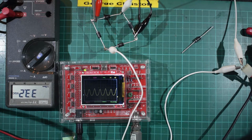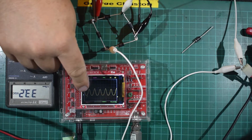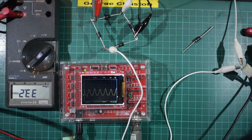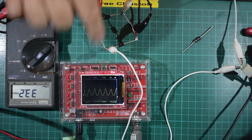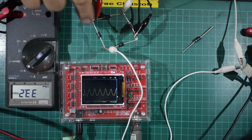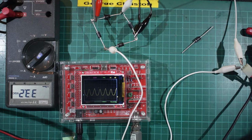Now, obviously, if you're going to make a power supply, you then have further stages to do. You need to put in filtering and work out the resistive loads and everything else. And I'm not going into the maths at this time of the morning, but I thought it'd be interesting to show you that a bridge rectifier actually doubles the frequency of the AC signal put in. So if we were putting 30 Hertz into here, this would be reading 60 Hertz now on the outside. As we're putting 50 in, this is actually set now to 100 Hertz.